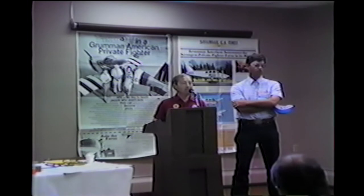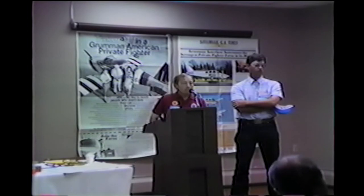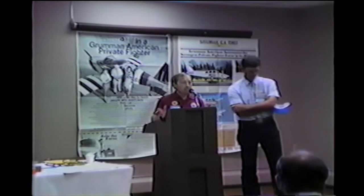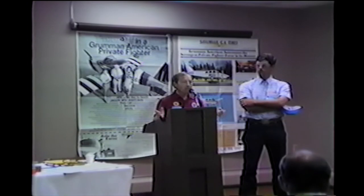I noticed on my elevator, on the one side, every once in a while it's rubbing slightly. Same with me. And if I just move it slightly, then it's working fine again, but later on it'll be rubbing again. Okay, what that is at the back, you've got a heat expansion of that ABS plastic that is something wild. That's also why dorsal fins break. Those suckers curl around like a worm, especially if it's dark paint. That thing gets hot, those suckers are pigeon toed in. I've actually had them bind up. I've done exactly the same thing you did, just reefed on them and got the things out.